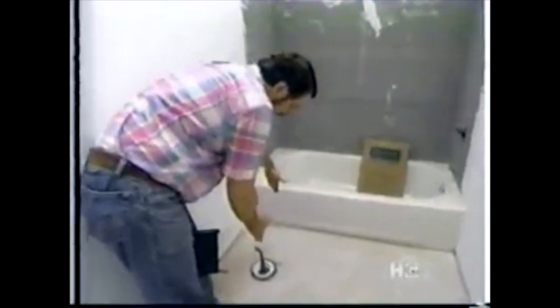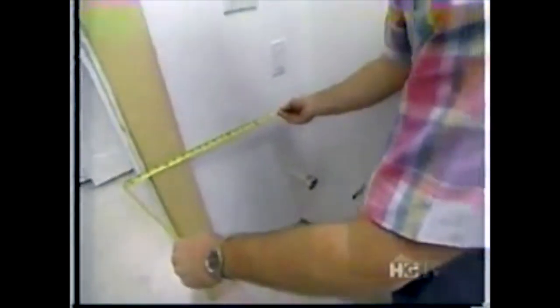So over in the other bathroom across the hall, I'm going to do something a little different. There are some considerations that we have to take into account. There's a toilet, and I need space for that. So it looks like about a 3-foot vanity will be the right length. The door casing is wide, and it gives us a narrow space here. So we can't have much more than a 21.5-inch cabinet. So with that taken into account, besides the fact that we'd like to build it 32.5 inches high, I think we can go to the shop, get every custom feature we want for a lot less than $700.